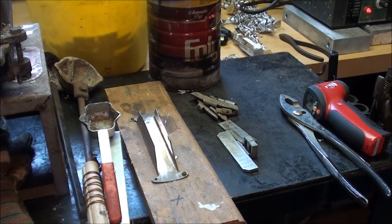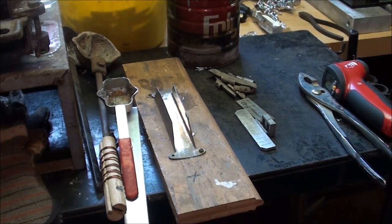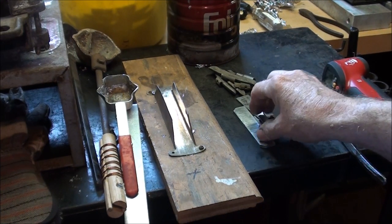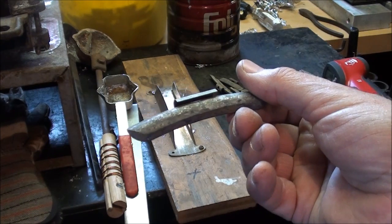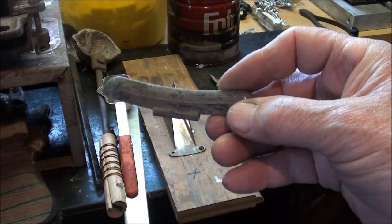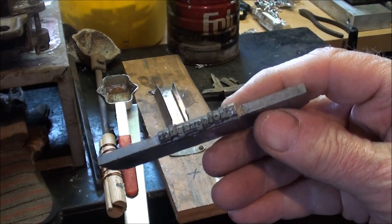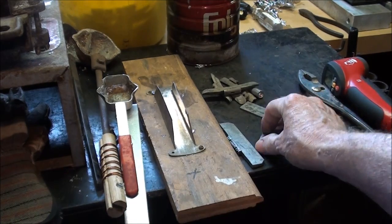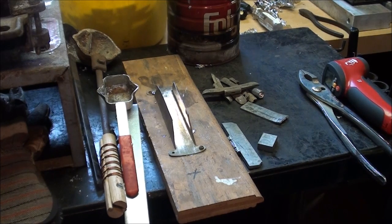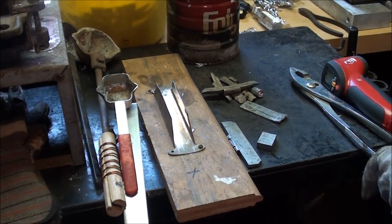This was a very common activity for boys years ago — you'd get one of these kits for Christmas, but it's a thing of the past. Lead can be melted on the kitchen stove if your wife will let you. My source of scrap lead is wheel weights, now illegal in Illinois because they say it's too toxic — to which I say rubbish — and also type lead from the old printer days. There's antimony in it which makes it much harder. Tin and pewter would also be great but are highly expensive.